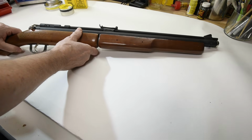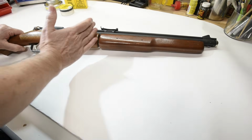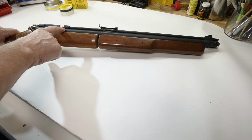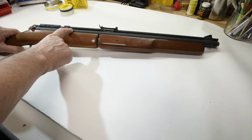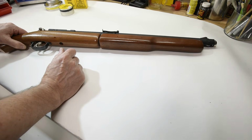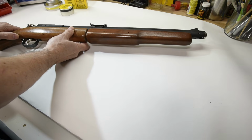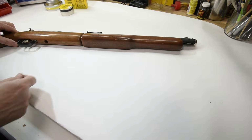These guns don't work that way at all. It's kind of weird. It's still an air gun, but things are a bit backwards. You compress the air ahead of time, pump it up into the chamber, and when you fire it, it is released down the barrel, and that causes the air to cool rapidly. So any moisture in that air you've compressed now condenses inside the barrel, and over time that could lead to rust. So the smart guys figured, hey, we'll make the barrels out of bronze. It's not a firearm. We don't have to worry about the heat of burning powders and things like that, and the barrels will last longer that way. Very cool.